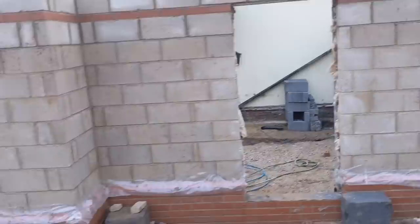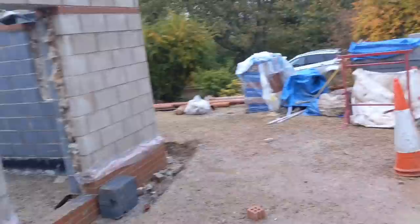We have done for today. Sat all the lintels on. Went pretty well, in all fairness. So I didn't get my scaffold boards till about 10:30. Not too bad at all. So we set all the lintels at the right height. Set the height for the joist inside, which is top of that brick inside.